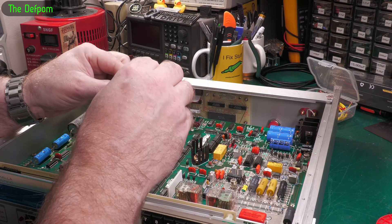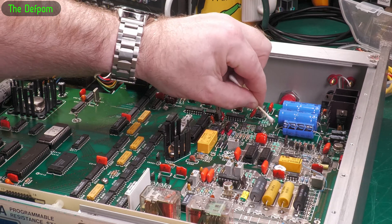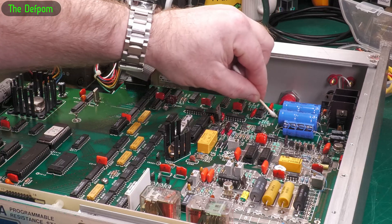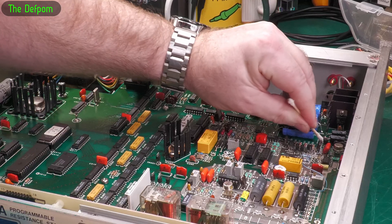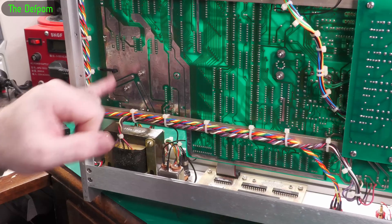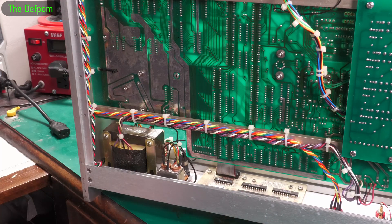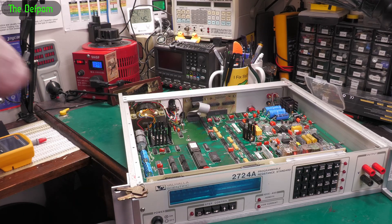You need a q-tip and some alcohol to try and clean the flux up, and then get around these things - just to leave them nice and clean and spick and span like it should be. Nothing too exciting about this, just give it a clean. I have to do the other caps on the other side as well - I'm not going to record the whole thing. So I've refitted that cable tie, cleaned up all the pads. I think I can put the cover back on again now. The only thing I've still got to do is take the EPROM out and make a copy of it. Let's check for any magic smoke and see if I put any caps in backwards.